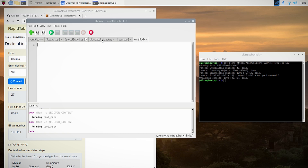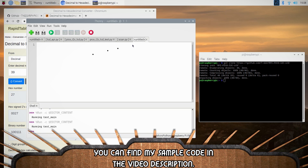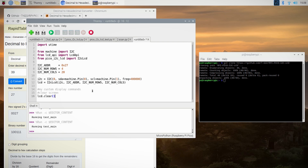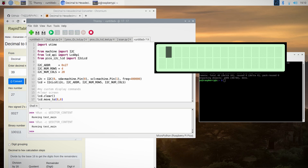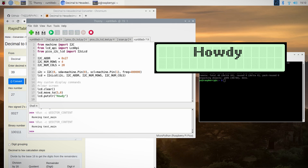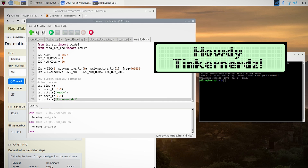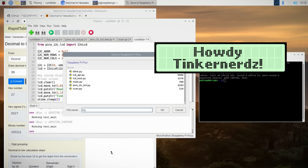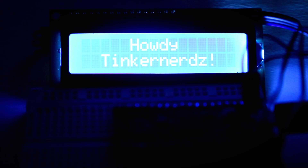I'm going to create a new script and copy over the header of the demo script, along with the two lines from the main loop that declare the I2C and LCD variables. The clear command clears the LCD screen, and the move_to command moves the cursor — zero, zero moves it to the top left corner. I'm going to move the cursor five characters in and use the put_string command to write a word onto the screen. Keep in mind you're limited to 16 characters per row. Then I'll move the cursor one character in on the second row and write the next word string. The utime.sleep command pauses the program for however many seconds we want the text to remain on screen. Let's save it to the Pico as my_LCD.py and run it.